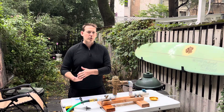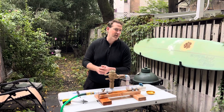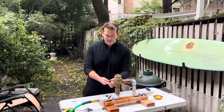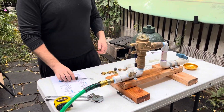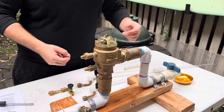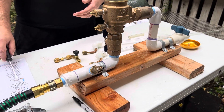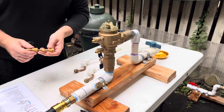Sometimes they want to know what those four words mean, so you should know what they mean. Open and close test cocks one and two. Install all appropriate fittings — this is a Febco, which is owned by Watts, so they generally have the fittings already in. Then place a bleed off tee on test cock two. This is a little different than the USC procedure, which tells you to put it on test cock one first.